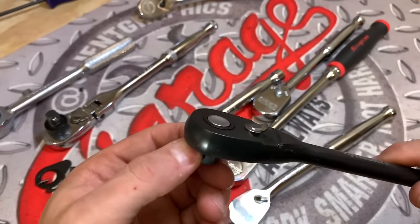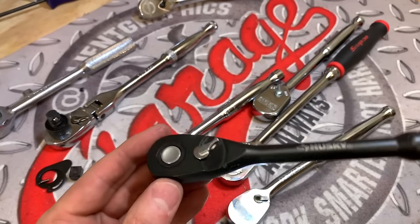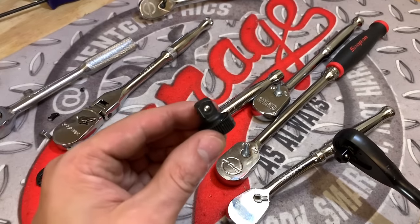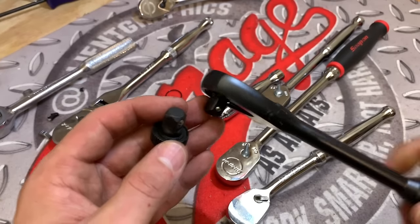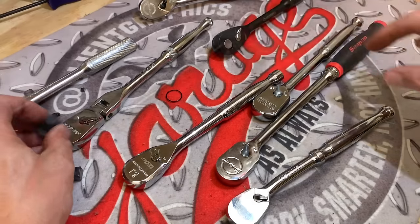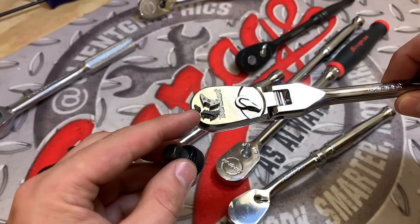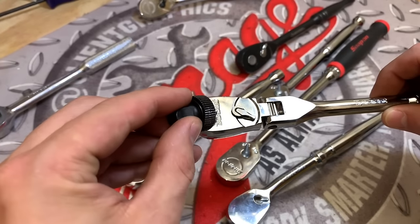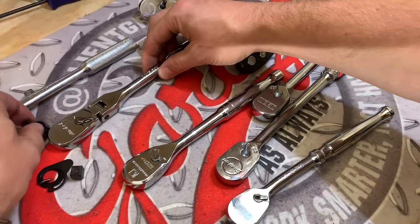The Husky from Home Depot came in at 259 foot-pounds — internals still working. The internals on the Husky are really similar to the 100-position dual-paw from Duralast. The Husky is a quick release where the Duralast flex head was not, which is probably why the Husky performed just a little bit less. The Duralast hitting 262.3 foot-pounds is outstanding — the cracked pawl caused the gears to round off and the tension just caused it to explode.